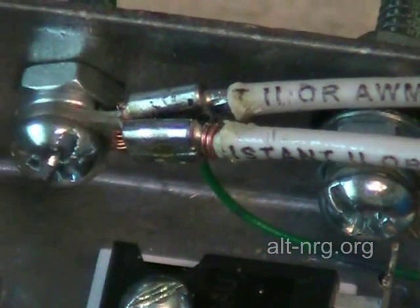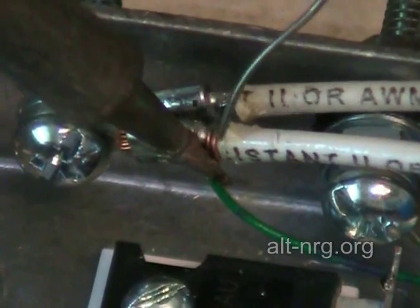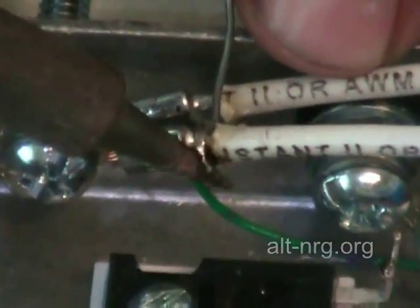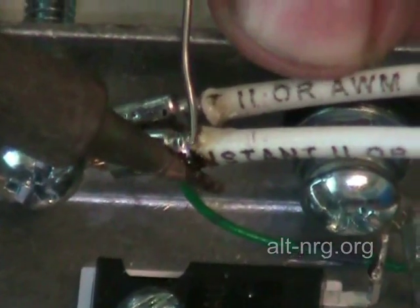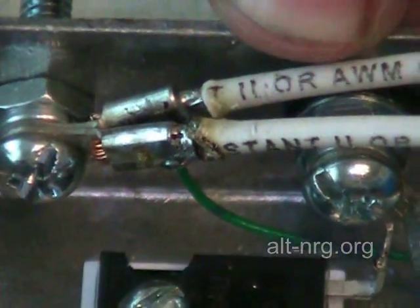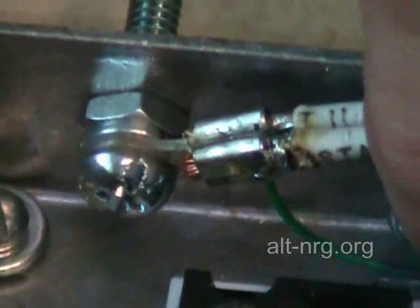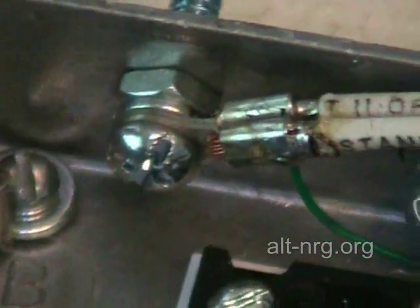This is very close to the metal of the case, so it's going to try and draw the heat away — it's going to act like a heat sink — so it takes a lot of heat to get the solder to flow in here. You have to really wait for the solder to start to flow, otherwise you'll just end up with a bead of solder on top of your work and it won't be making a good connection. That takes care of that.